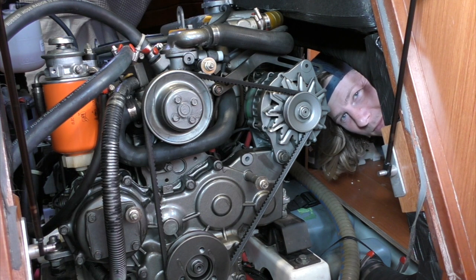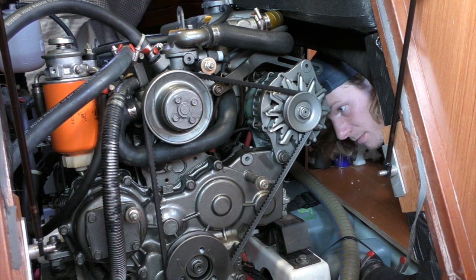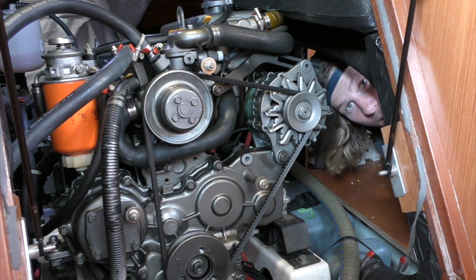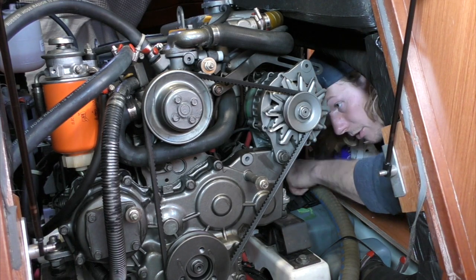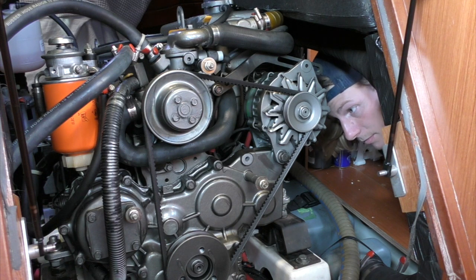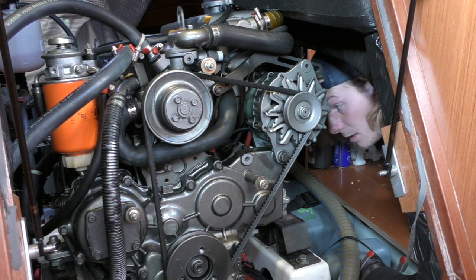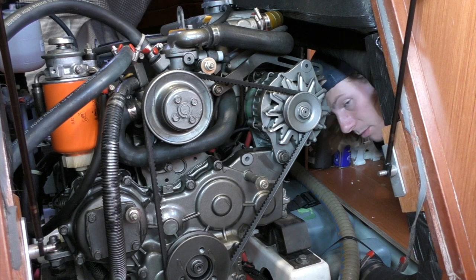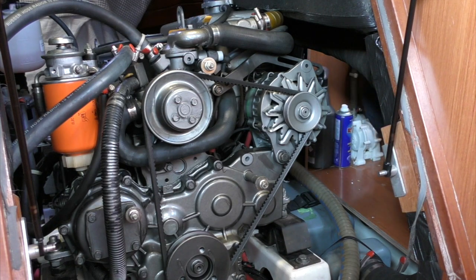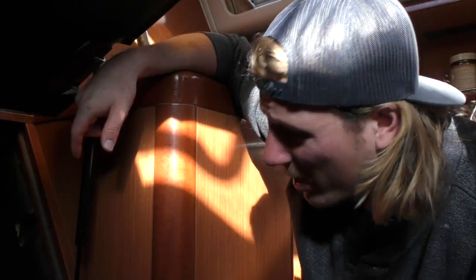It is, but you've got to remember the pump's only running with a bit of fairy liquid around it. That's right. Yeah. Because it took me a bit to fill up, because I had to fill through all that pipe work, all through the oil cooler and all the rest of it. So it's always best to prime them. And everything's good. There was no oil leak anywhere, which I don't know if that's normal or not. But there's no oil leak on this one, thank God. Nice. But I change them every 200.